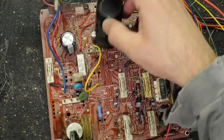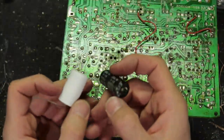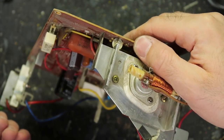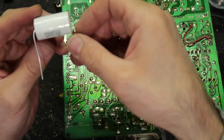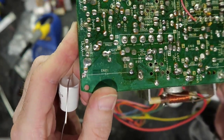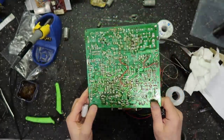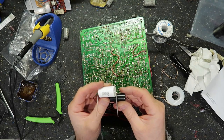Look at the size difference on that. The new one you can get from Ian is 0.1 microfarad 1600 volt. I can't tell if it's polarized or not. I'm fairly confident I'm making the right decision — you see this symbol, you have the capacitor symbol but there are two straight lines, one not curved. Two straight lines usually means it's non-polarized — it doesn't matter which way I put it in. There are no markings indicating polarization.